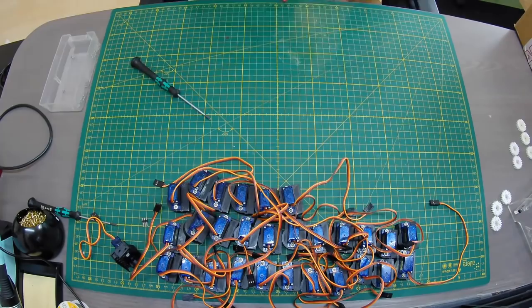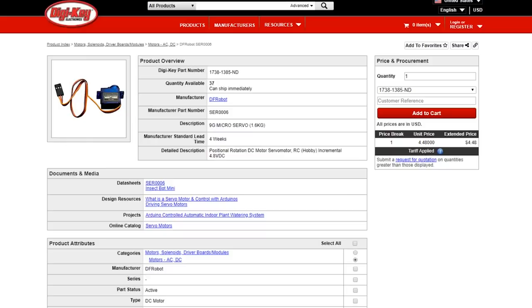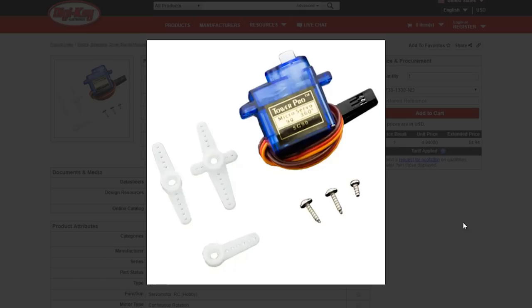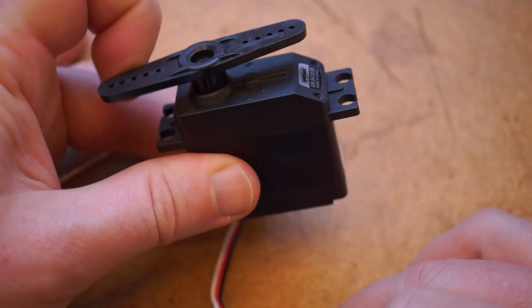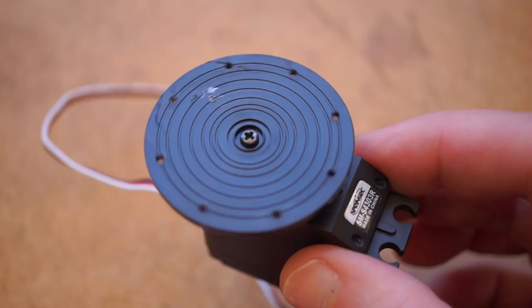I like to do a little product spotlight at the end. This week, inspired by the servo-controlled word clock, let's take a look at the same SG90 microservo used to move those letters in and out of focus. These are available on Digikey for under $5 and come in two flavors. The standard option is a positional rotation servo limited to 180 degrees of movement — that's what's used on the word clock. You can also get the same servo in a continuous rotation option, meaning it can continuously rotate in either direction. The downside is that you can't recall these back to a home position, so they'd be no good for the word clock. But they're great as little geared motors for slowly moving things, perfect for small robots, with all kinds of interesting attachments you can stick on them. You can find Digikey links for both options down in the description.